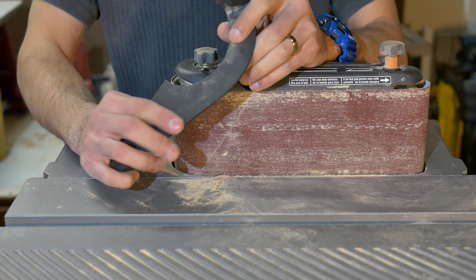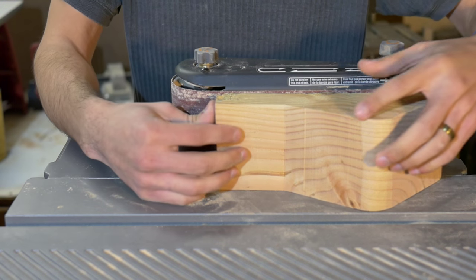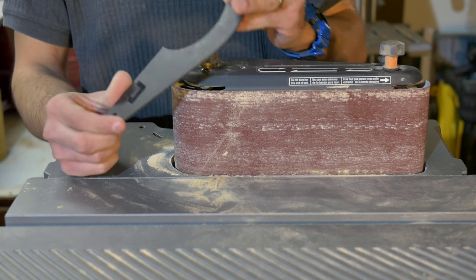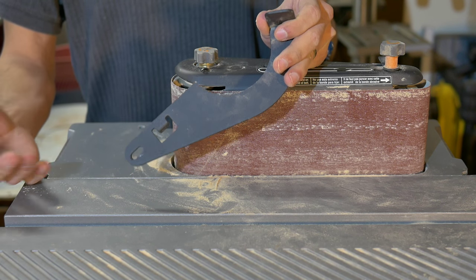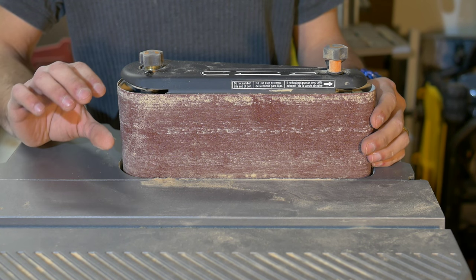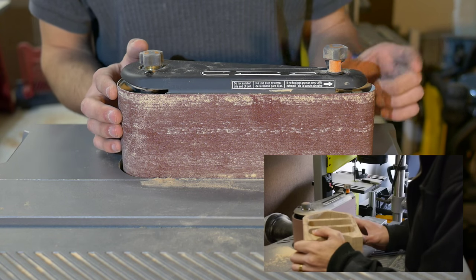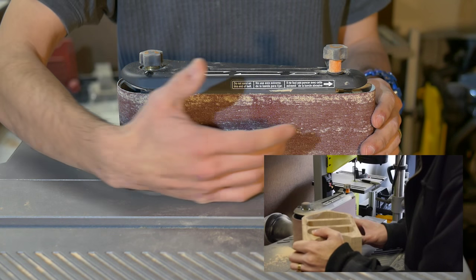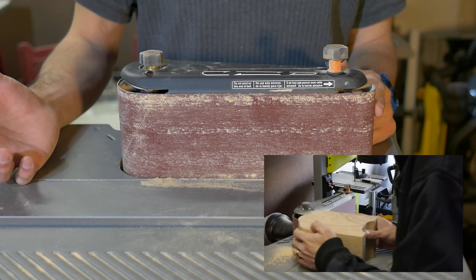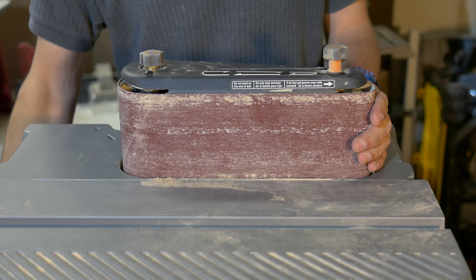In addition to the belt sander there's an included stop plate accessory, which helps keep the item in place as the belt sander is being used. I found this to be a good idea for beginners, but in practice I didn't use it at all — it's just another accessory to install and remove, so I leave it alone. With many of my recent projects like making bandsaw boxes, I needed to sand lots of flat surfaces, so the flat portion of the belt sander fit my needs perfectly. I also found I could use the left and right round outer edges to do sanding on curves — so it's like having a belt sander in the center, a three inch sanding drum on the left, and a one and a half inch sanding drum on the right. It makes life easier as I can sand flat surfaces and different size curves without having to remove the belt sander piece to use my sanding drums.